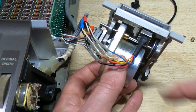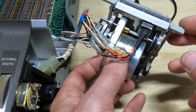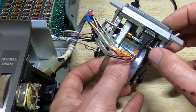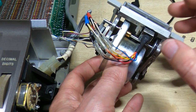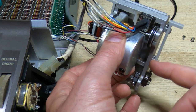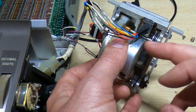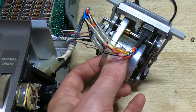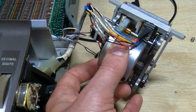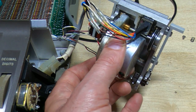I can just take this off and put one on there. But it looks like someone's had an attempt at repairing this, and I had assumed it was working at some point and the failure was just the capacitor, but it looks like this hasn't worked for quite some time. Chances are the original friction pulley just disintegrated and somebody put this on and didn't realise it was supposed to have a flat section, which you wouldn't if you'd not seen an original, and the reason they were changing this presumably is because the original one had fallen to pieces.